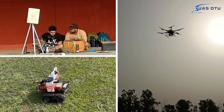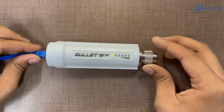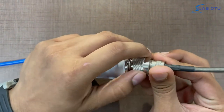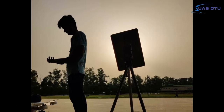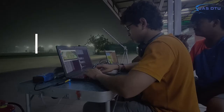Multipoint communication between the UAS, UGV and GCS is achieved by the use of Bullet radios operating at 2.4GHz WiFi. The team switched from RFDs to Bullets as they provide better range and higher accuracy. To improve range, the antenna is mounted on a movable tripod and is pointed towards the UAS throughout the mission. The team tested multiple antennas and finalized the one which provided a range of 5km as per the mission requirements.